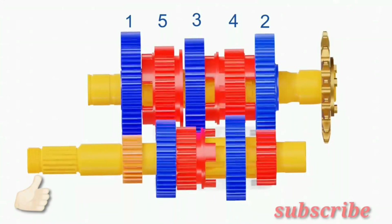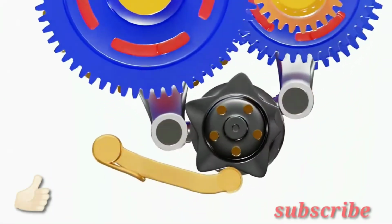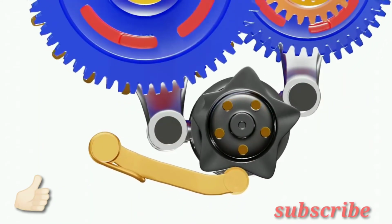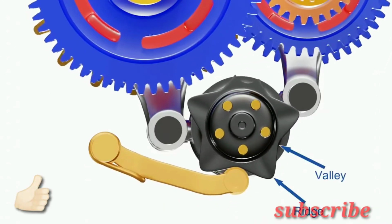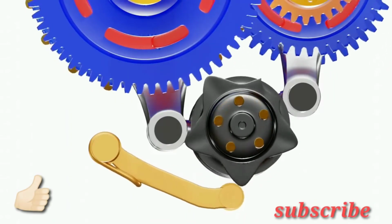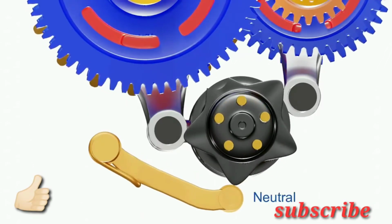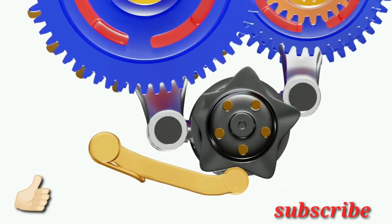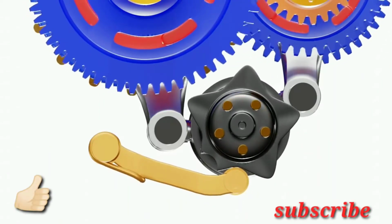This is why there is a neutral in between every successive gear. But in real life, we find the neutral position only in between first and second gears. To understand how this happens, let's go back to our ratchet mechanism. A star shift detent mechanism is responsible for proper shifting of gears. As we can see, the star plate has ridges and valleys. A spring-biased roller rolls onto these ridges and valleys. The position of the roller at each ridge of the star corresponds to neutral condition. As we can visualize, the roller cannot rest on the ridges of the star and immediately disposes to the appropriate valley, preventing the shifting drum from stopping at neutral position.